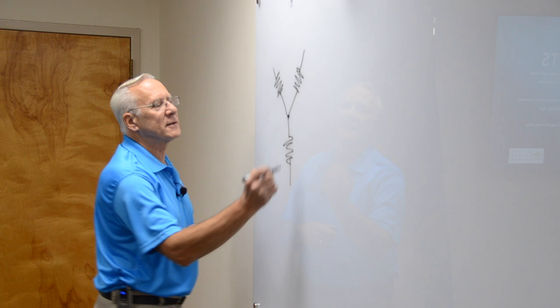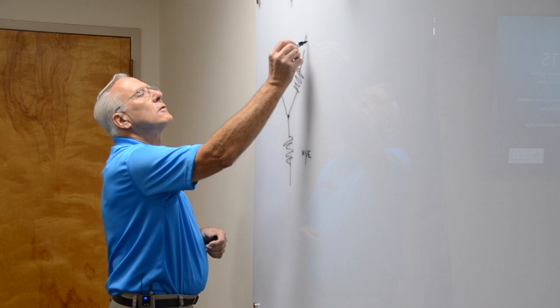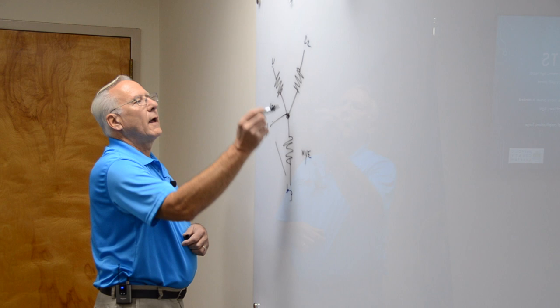Excellent. There's no such thing as a flux capacitor, but you are correct. This is called a Y, W-Y-E. Most of the schools I've ever been in on Long Island have a Y. It's L1, L2, L3, and this is neutral. Any L to neutral is 120, any one of these, here or here. Any L to L is 208.